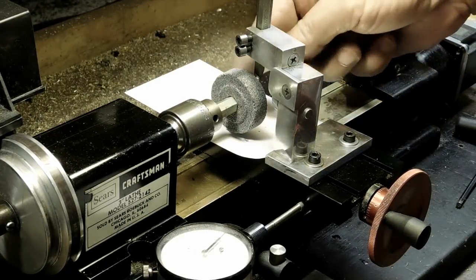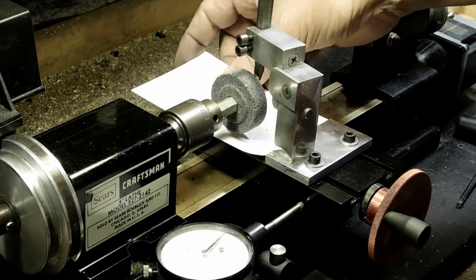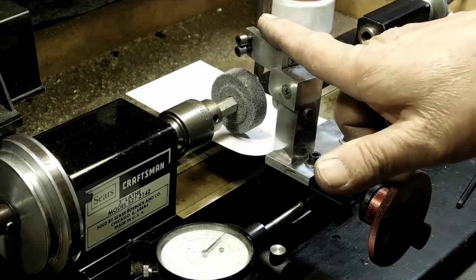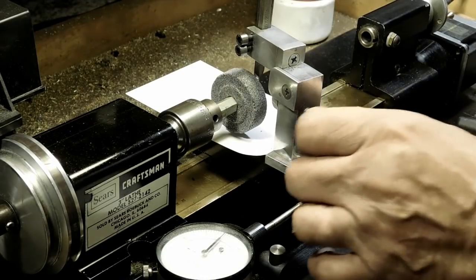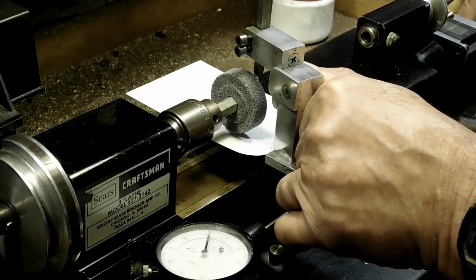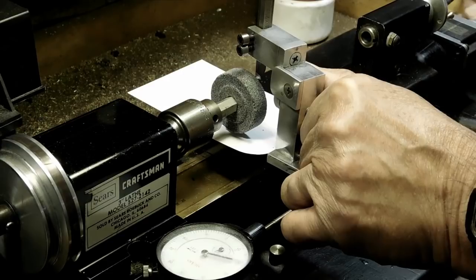I faced off the front of the stone and put down some protection for the grinding paste. This is set at 8 degrees to do an 8-degree relief on it, and we have a dial indicator to tell us where we're going. The first thing we have to do is hold it like that and bring it in until the lathe bit just touches the stone.